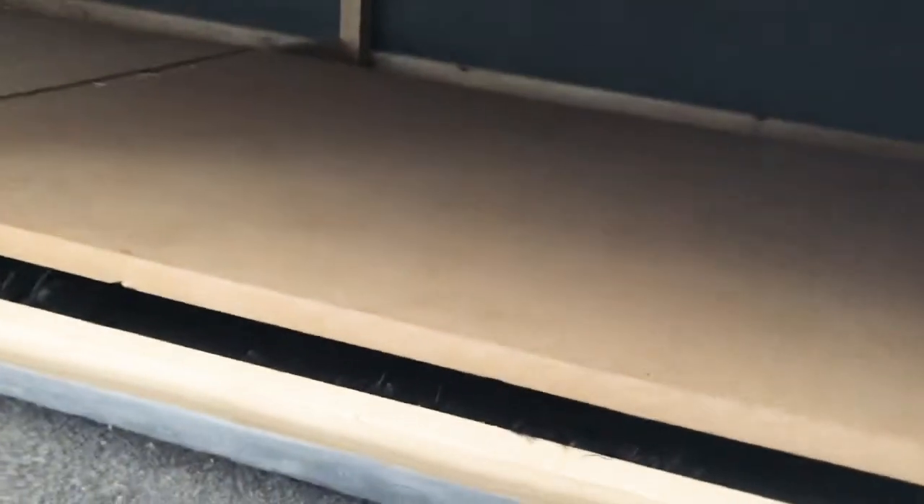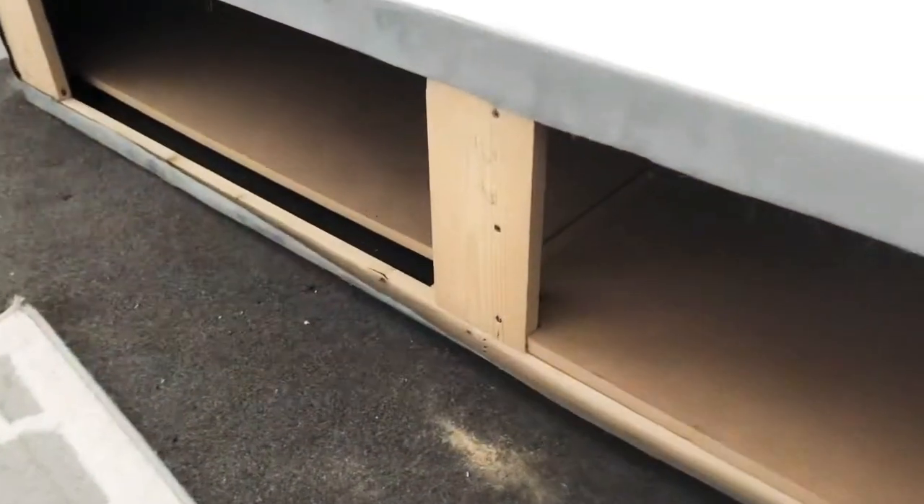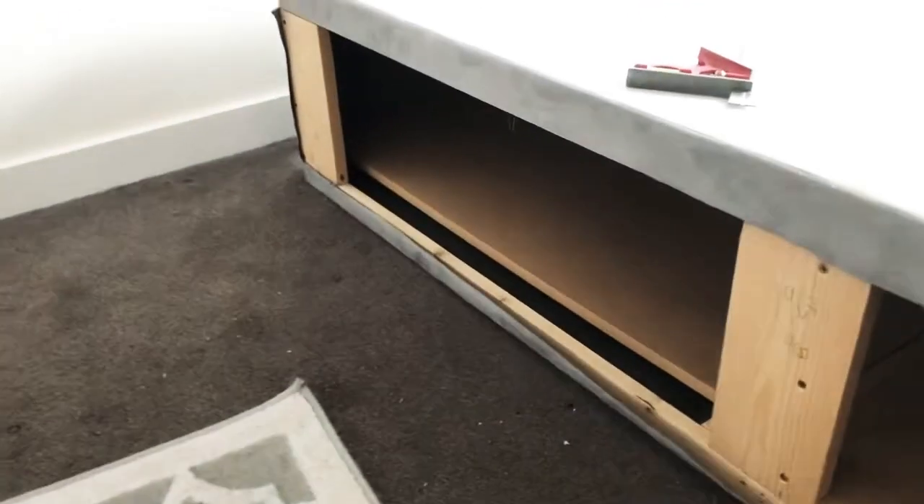There is going to be a gap at the back, and we could fill that with some MDF as well, but I think with the baskets and everything we're planning on putting in here, you'll never see that. So that might be an addition later on. The first one is scribed in — you can see the difference, that to this big gap on this one. So I'm going to scribe in this one, cut it round so it sits flush, and then we can start thinking about cladding.